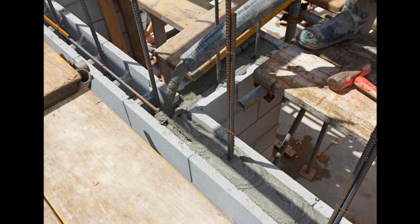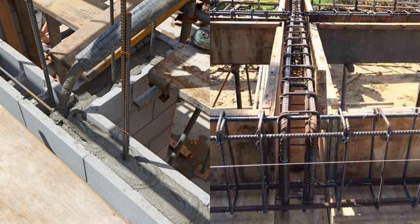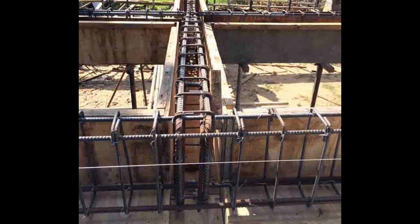So with that in mind, let us consider these two separate methods of construction side by side. Both are achieving exactly the same goal. If you are constructing a multi-story building, the one on the right is exactly the way to go. But if you're constructing a single-story building, there is absolutely no necessity to have that overbuilt beam inside of the building. And in fact, there is no necessity to have all those expensive forms and so on.